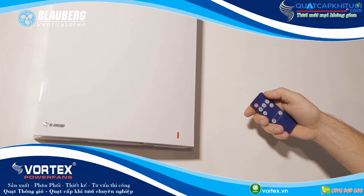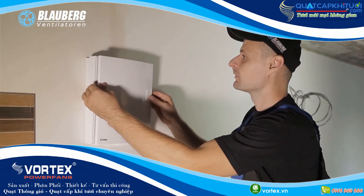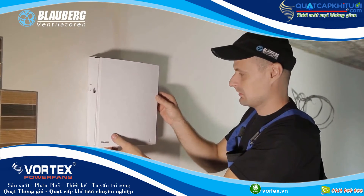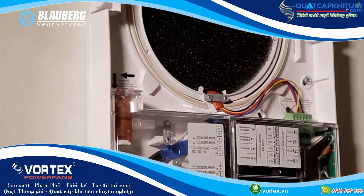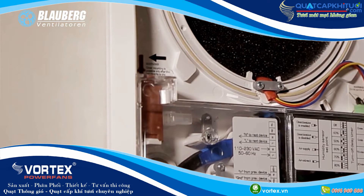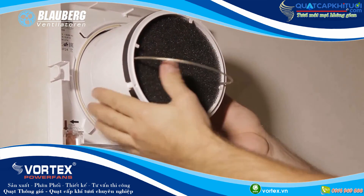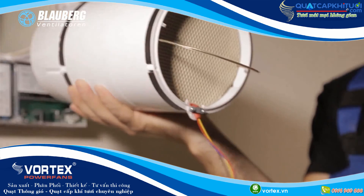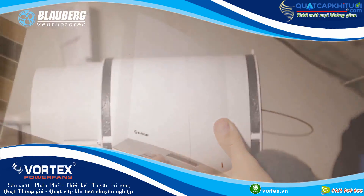The ventilation unit is rated for permanent power supply and continuous operation. Disconnect the ventilation unit from power supply prior to any maintenance operations. Press the side tabs to remove the front part of the indoor assembly unit. When installing the front panel back, make sure that the thermal actuator rod is down; if it is raised, wait until it goes down, about 2 minutes. Remove the socket connector from the control board. Pull the cord to remove the cartridge from the air duct. Remove the filters from the cartridge, clean them as required, flush with water, let them dry out, and install the dry filters into the air duct.